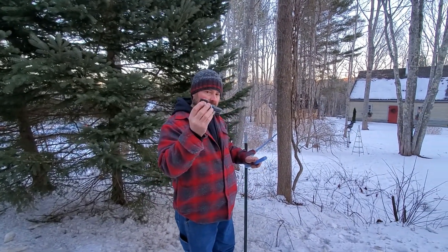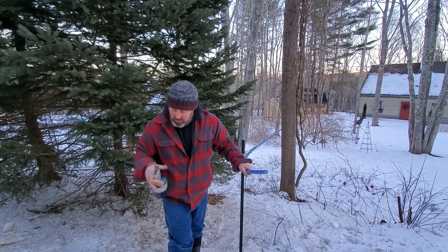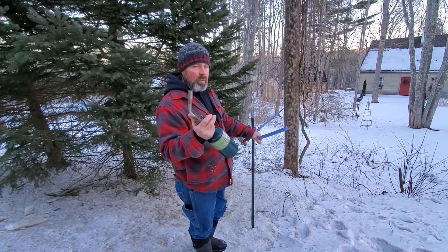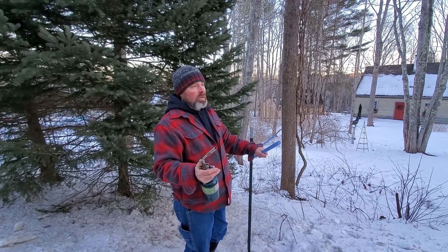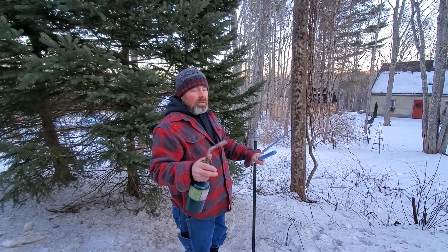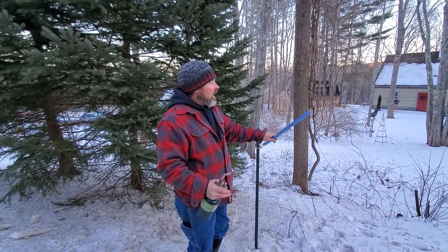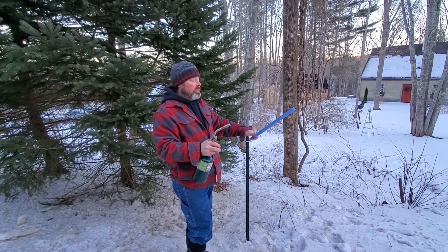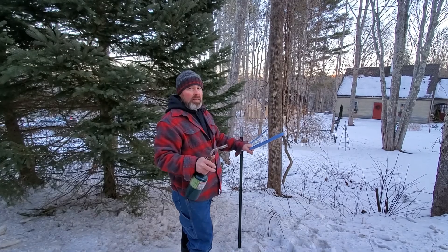I don't want this open — it's sealed off at the tank and I don't want anything getting into this pipe. We're going to use a little propane torch and just get it a little bit soft with some heat. If you don't have one, battery-operated or electric heat guns work too — even a hairdryer if you want. These aren't that expensive and are really useful especially in winter in New England. This pipe being rigid, I can heat it and kind of run down the line to straighten out the curl, just don't get too close or you'll burn through it.